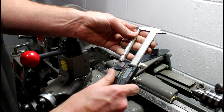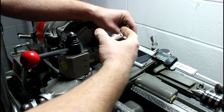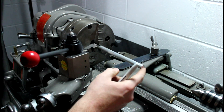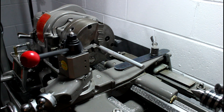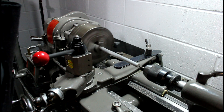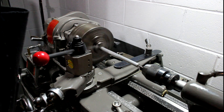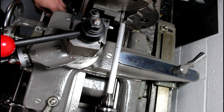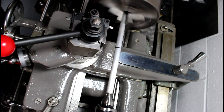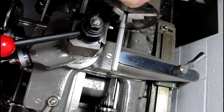We're gonna start whittling away and see what we come up with. That's a little over four inches, so I'm gonna crank it out just a little extra, make a mark — there we go. That gives us an idea of where we can start. Now I want to spot a little center in there, and this will later become our threaded portion. For now it's gonna be our dead center. I'm gonna cinch this up a little bit — I'll probably get some chatter otherwise, so I want to get that as close up in there as we can.